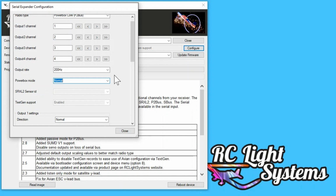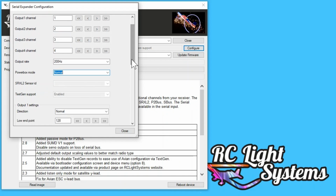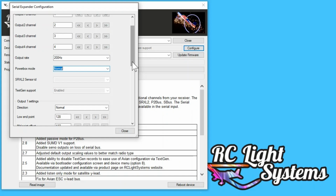So if you've got PBR26Ds that you're connecting to another system, you may want to have this sitting silently, sniffing the channel data and not talking back, not being a sensor, but just directly running and outputting extra channels. Of course, if you do that, you can't use the Powerbox menus to program it. You have to set it using the assisted learn or direct setting using the button.